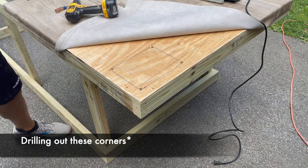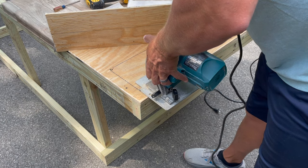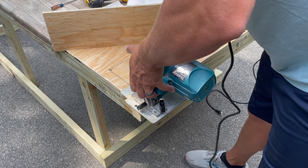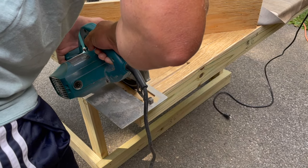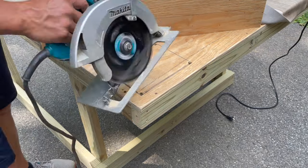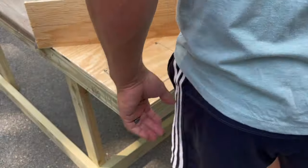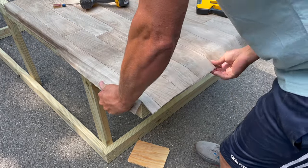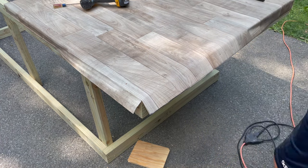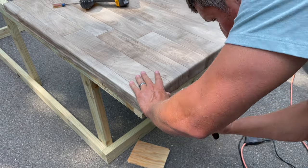I think I was planning on initially using my jigsaw, but the blade kept rubbing against the outside corner framing - it was a little too close to where I drew my line and drilled my holes. So I decided to use the circular saw. This is called a plunge cut - you pull back the guard and sink your blade into the wood while it's already running full speed. That's probably one of the trickier cuts in this build, and you definitely want to make sure you practice it before you attempt it on your coop platform plywood. There's a bit of a learning curve.